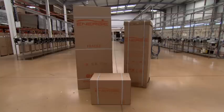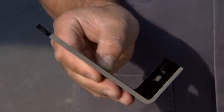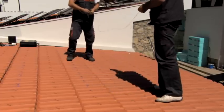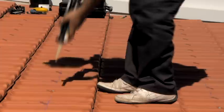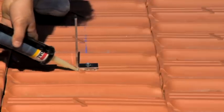All the components of the EcoThermo models are carefully packed in individual boxes. Solar panels are typically secured with an L-profile aluminium structure, which affixes the panel to the surface at six points. To secure the tile, follow these steps: mark the point where the tile will be drilled, drill the tile, place a bushing, apply a bit of silicone, set the profile and screw it tight, then seal the base of the fixing with silicone.